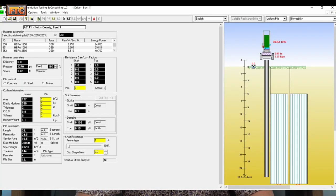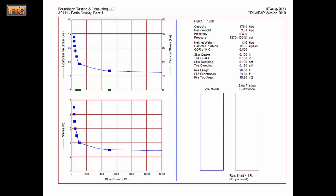When installing other piling that doesn't have PDA, you can get a rough idea of whether the hammer is operating under the same energy and whether the pile is providing similar resistance to the test pile. There are also instances where someone will model pile driving using wave equation analysis — that's a computer program — where you get a relationship between hammer ram stroke and pile set for a given capacity, allowing you to verify whether required capacity has been achieved.